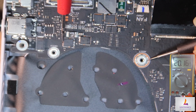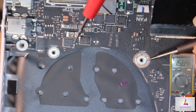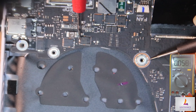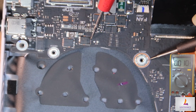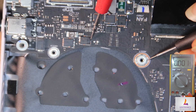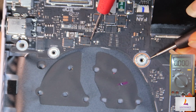This 20 volts is supposed to cross from the source side to the drain side of the MOSFET — you'd expect to see 20 volts there. But unfortunately we're seeing nothing — zero volts. It's supposed to then make it to the source and drain of the second internal MOSFET, and eventually reach the current sensing resistor on the other side of the board.